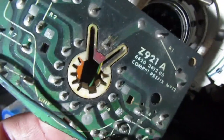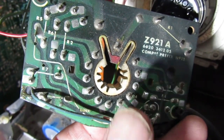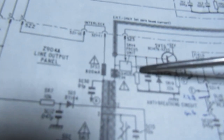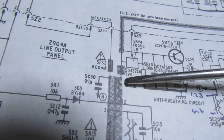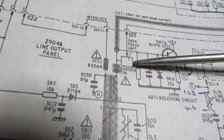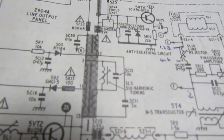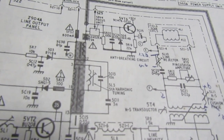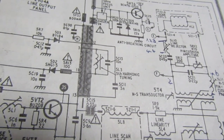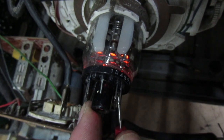I'm applying 6.3 volts from the bench power supply and I can see the heater has lit up, so we know the tube has vacuum at least - that's a start. Now, looking at the heater voltage problem: it's a winding off the line transformer through a variable inductor to set the heater voltage, coming out on pin 1. The other pin 14 on the line transformer passes into pin 11 and comes out on pin 12 through the east-west modulator transformer, out to pin 3 of 5Z4. Putting an ohmmeter across pin 1 and pin 3 with the tube base disconnected, you'd expect a virtual short circuit, but I'm measuring about 10k. Somewhere in this circuit there's a break in the heater chain.